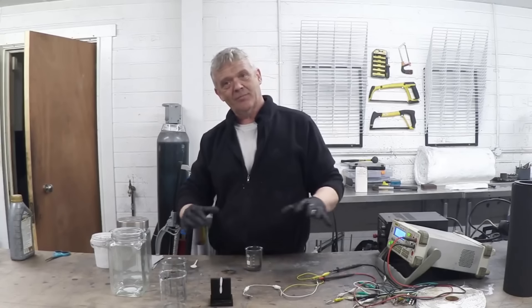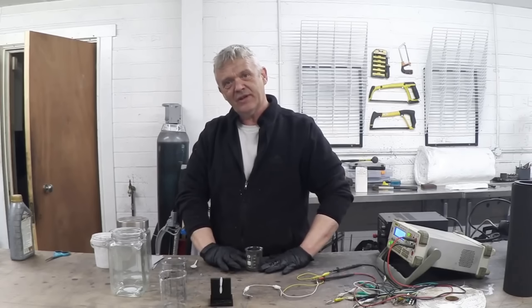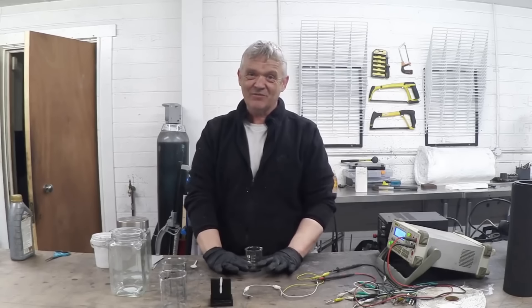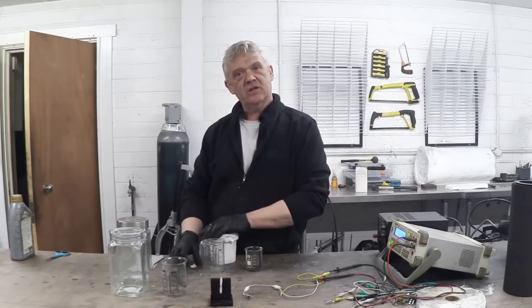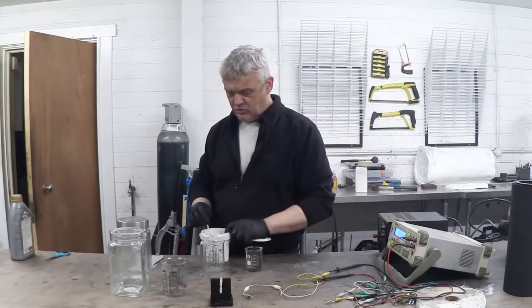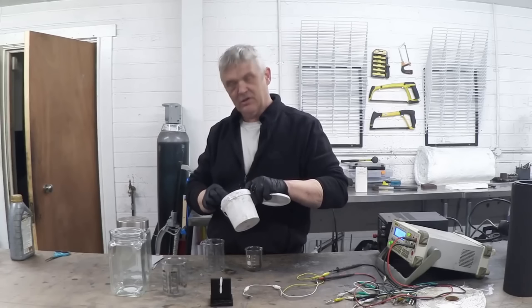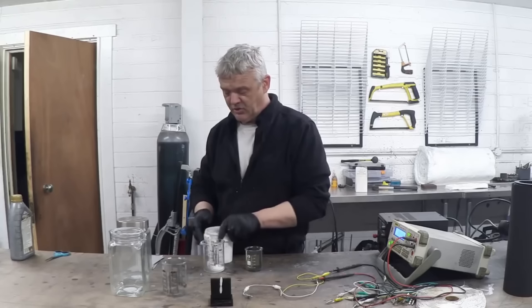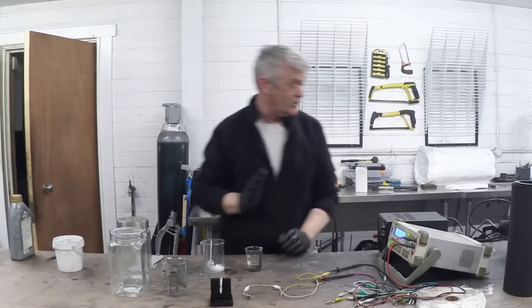The carbon electrode at the bottom will be the positive, because the bromine anion is attracted there. Bromine in solution is higher density than zinc bromide solution, so gravity keeps it safely at the bottom — which is really awesome. The battery power is directly related to the amount of zinc bromide you can put in, and zinc bromide is an amazing salt: you can get huge concentrations. The molarities can go as high as five to seven moles — it's astounding.